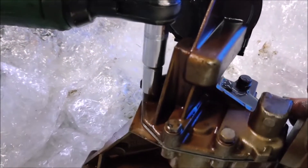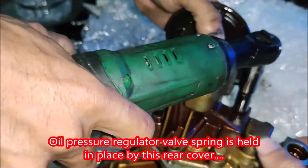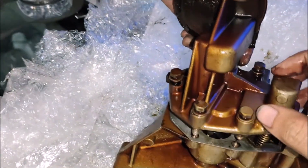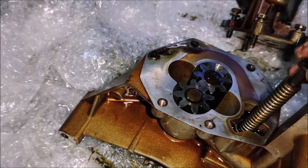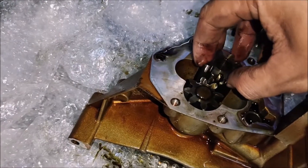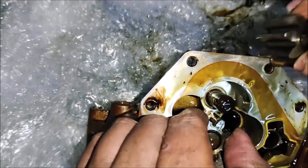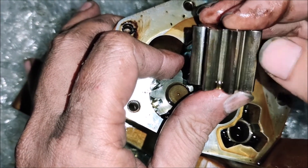Here's the oil pump assembly — already loosened the bolts, six 10-millimeter bolts. There you go, the rear cover. I will examine the condition of the surface here of the aluminum. The oil pressure regulator spring — we're just checking the condition of this oil pump. I'm going to pull out this gear. Looks like the gear is still good.